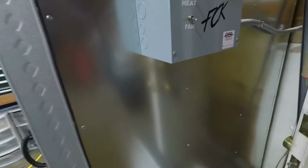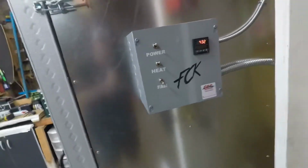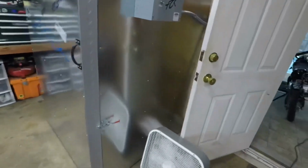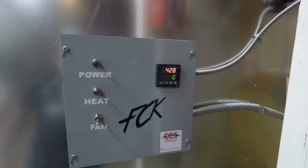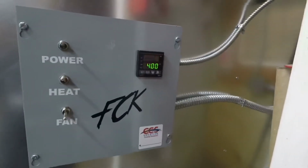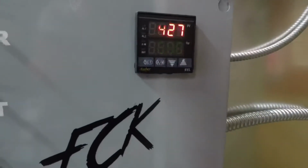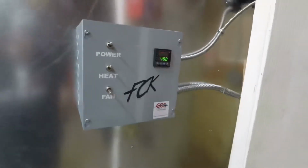So, all right, I can't wait to see what this thing comes out like. We got to get it to flow first. So, all right, guys. So we've reached our internal temp of 400 on the actual part. Checking it. So now we're in our 20 minute bake cycle. I've dumped it from 450 down to 400. So the temp's coming back down now.